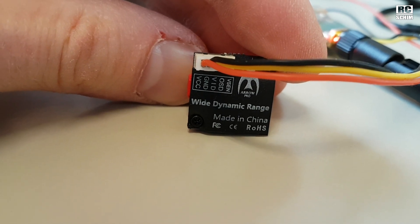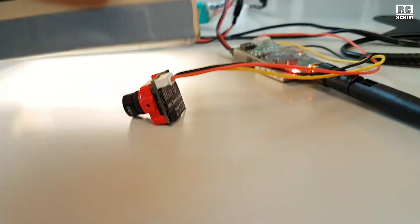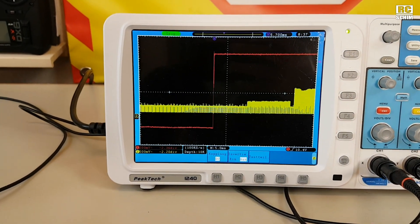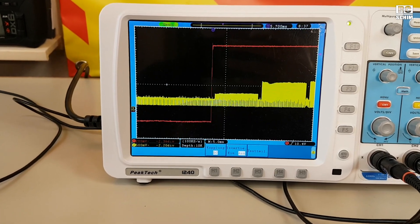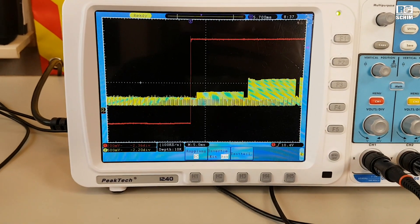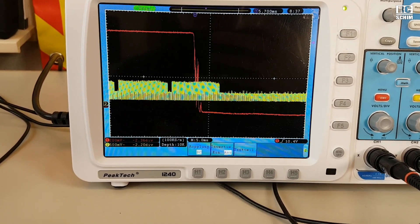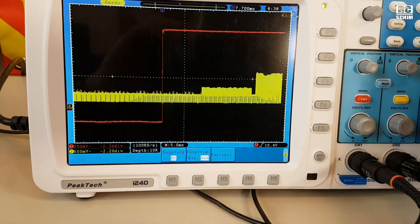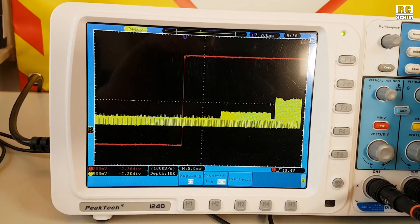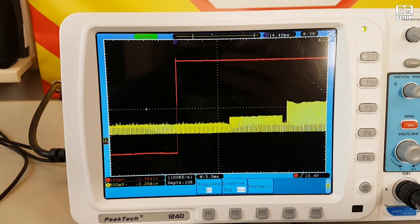Out of curiosity, I test the Erbo Pro, and I think this is a CCD cam. Let's see what a CCD cam does — we always had the notion that CCDs were the fastest, though that's not the case anymore. You see the change: the CCD doesn't always start right where the latency begins; it's rather frame-driven. This is a half frame and it's half lit; this one is fully lit. Now this frame starts at 14 milliseconds, now a bit more, now it's better — about 10 milliseconds, now 5 milliseconds.